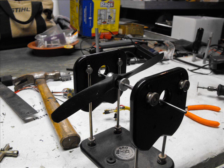I think what we're looking at here is pretty self-explanatory, just rebalancing the prop. Once the shaft is bent, just to make sure I've got everything squared away, I want to double check every last piece of it to make sure everything is perfectly balanced. If I know everything is balanced and I'm having vibration, I know my shaft isn't quite right. So in this picture, I'm going ahead and rebalancing the prop, cleaning up the little dinged ends.